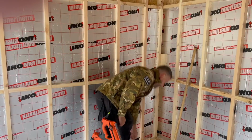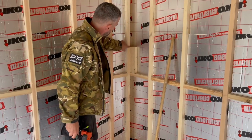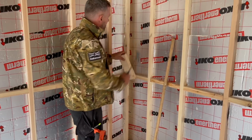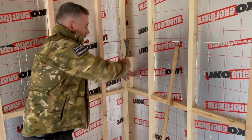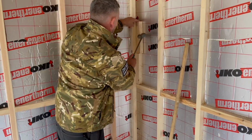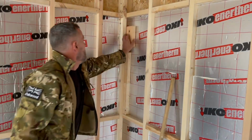Right, plasterboard carriers. So your plasterboard will go that way. Obviously you'll fix the end of there, that plasterboard's good, but this one here has got nothing to fix to there. So we've insulated it first. We'll get us off cutting noggins, drive them in like that. Normally we put these in full pieces, but it's something I've forgotten to show you, so I'm just going to pop these bits in that we've got on the floor.